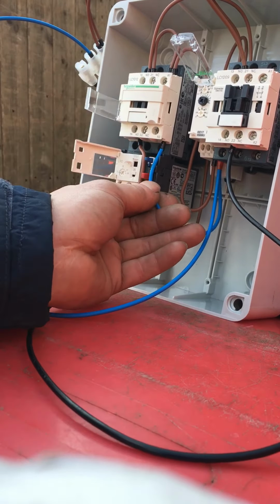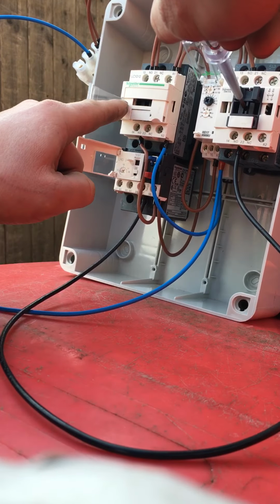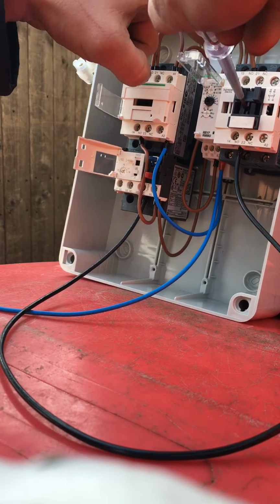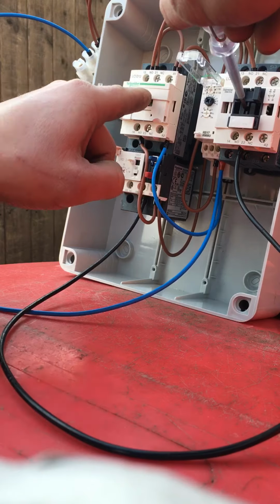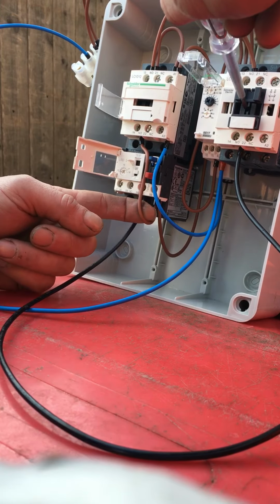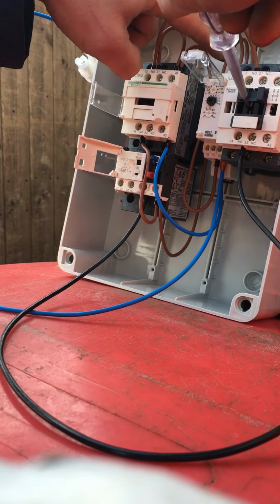Now with the Schneider timer, this contactor is latched in when that's made. It's latched. As soon as this contactor is energized, this signal to Y1 on the timer at the back here tells this switch inside here, which was normally closed, so there was power going through 15 and through to 16 on the bottom to energize A1. As soon as the contactor pulls in, that feed is made, the contactor latches on because we've got this bypass feed going over, which tells Y1 at the top there.